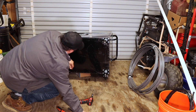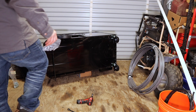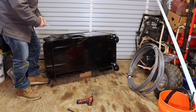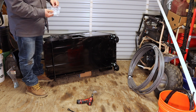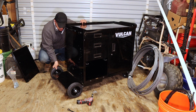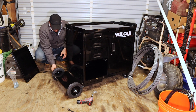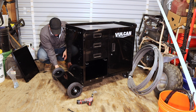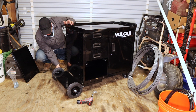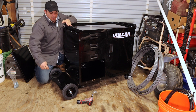Those two casters are done. We've got the eight-inch wheels — they feel pretty solid, eight by 1.75. We're putting in the little axle and axle nuts. We've got our one wheel on; let's lift this up and get the other wheel on. Put a little washer on, a little lock washer — might even be worth throwing some Loctite on that. And we'll tighten that down; that's 14 as well.